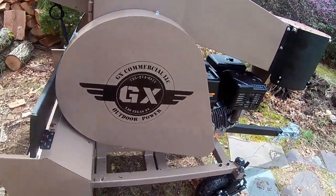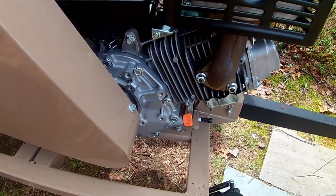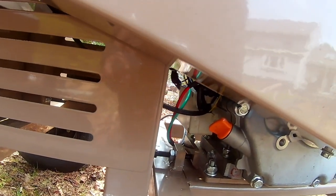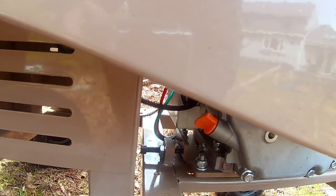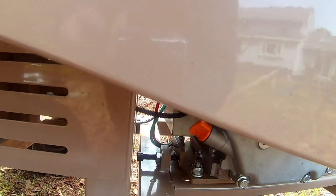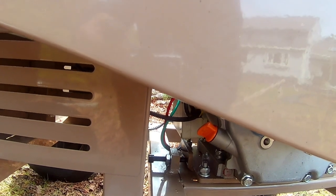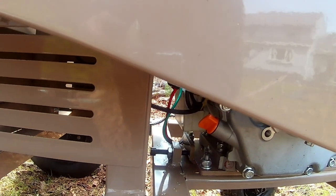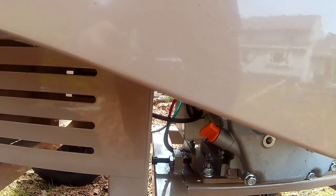All right, so here's some other issues. I'll talk about the oil a little bit later when we try filling it in. I don't know if you can see this, but there's the dipstick, and the dipstick is this orange plastic. First of all, it's kind of hard to reach. Initially, I had trouble finding it. And on this orange plastic, the oil doesn't really show very well. So I'm going to fashion my own dipstick using some black plastic, actually a wire tie, that will be the right length to give me a reading.